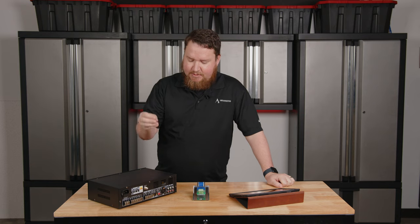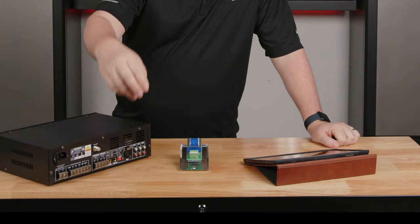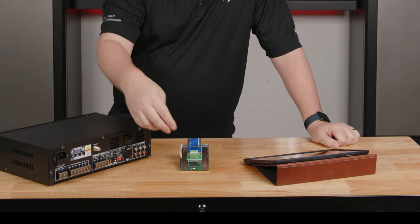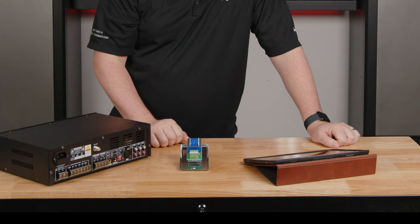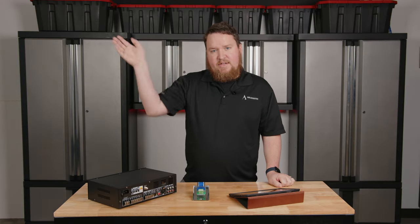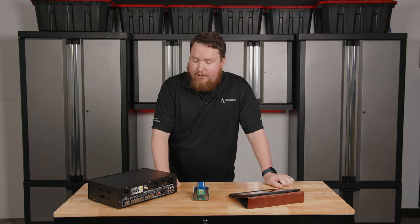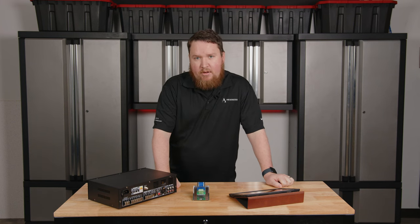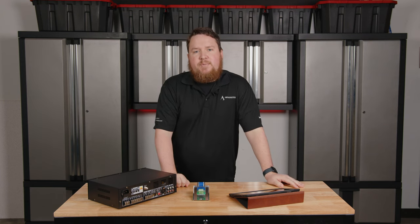The basic idea is: left and right channel go in, sum to mono, mono out of the amplifier. You can then go mono into a volume control — you're not going to find a left and right in a 70 volt volume control. Then you output from that to your speaker and daisy chain for the rest of the zone. That makes sure all your speakers play the same information in all areas, giving a more cohesive musical experience in your space.